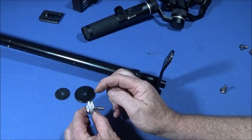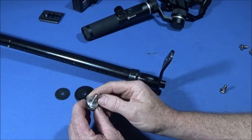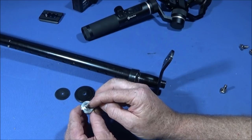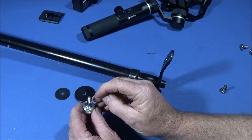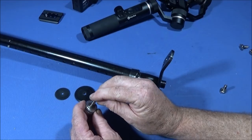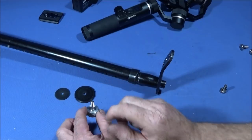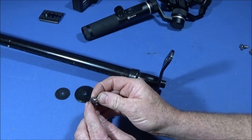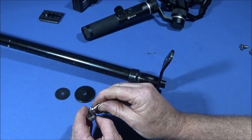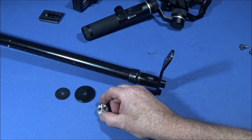I turned it, knurled it, and did a decorative groove in here. And then I drilled down to a certain depth, a bit smaller than the diameter of the head of the screw, and then bored it out to a depth which is about the thickness of that actual screw head. And it is a nice fit on the diameter. And then I got Loctite 638 and put it in the slot, all around the diameter and in the bore there. And then I just pushed that one home, nice and square, and let the Loctite 638 harden.